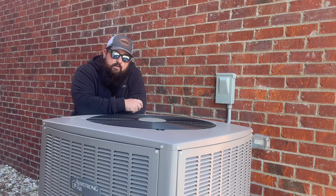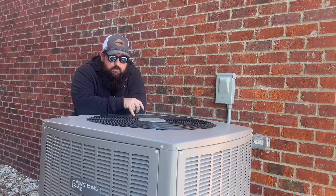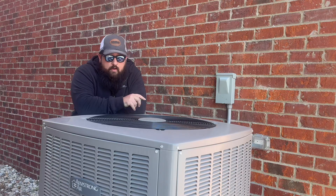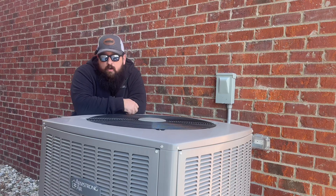Here's the reality of the situation: at some point in your career you're bound to come across a compressor that has had a burnout, so we know that the refrigerant inside of this system has an acidic value or is contaminated. Now we don't want to damage our recovery equipment, but this refrigerant still has to be recovered.